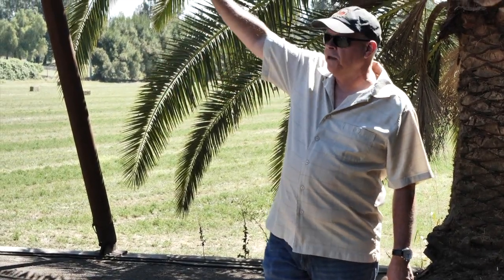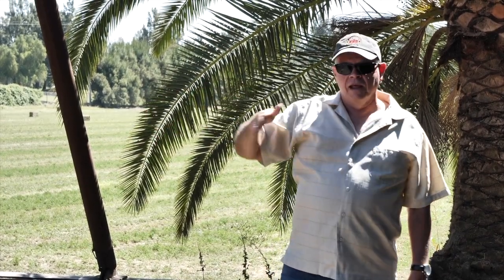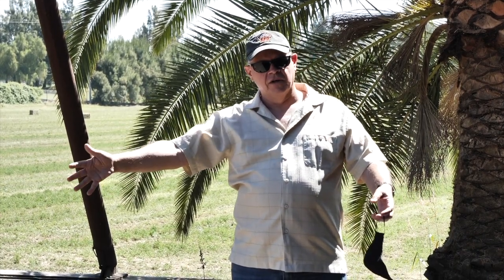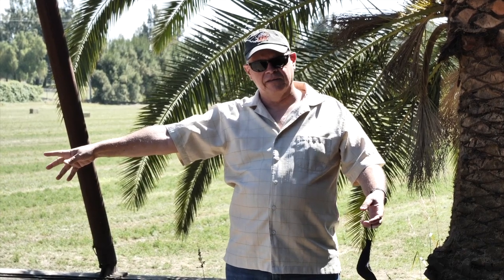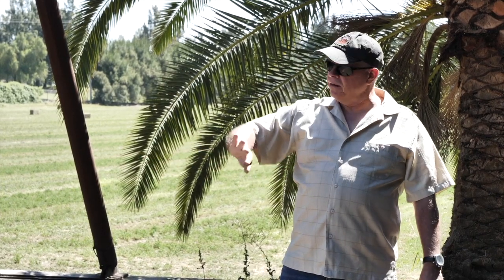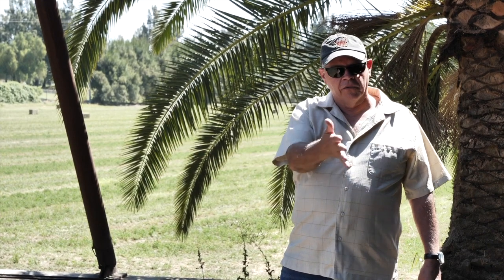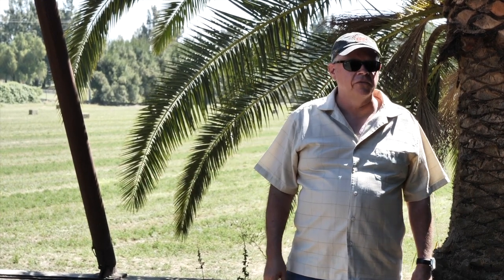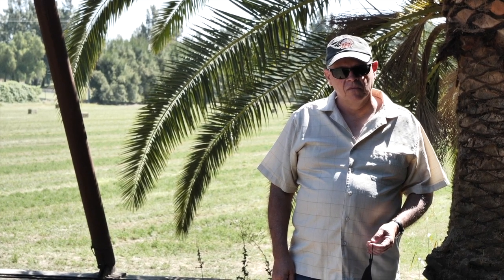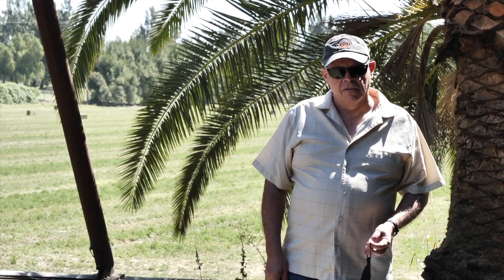When you pull up the screen, we also have a drop-in gate so that fish can't go through when the screen's not in, right? Mm-hmm. And then it goes through the levee, and at the back of the levee, there's a structure right before it goes into the sedimentation basins. And that's also for isolation, but one of those gates in there, on the downstream end, it's like 100 feet away, will control the flow through that pipe, which controls the flow that comes in through the stream. So the flow from the intake should never be stronger than the natural flow. I thought I heard you guys say that earlier.